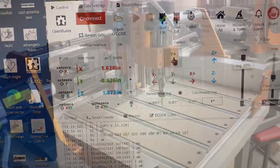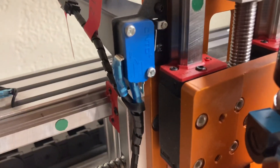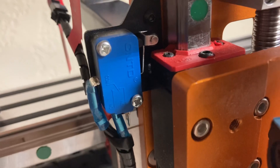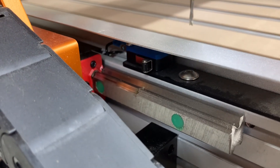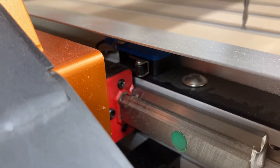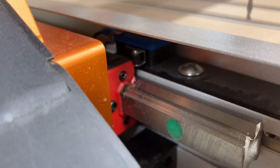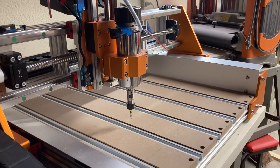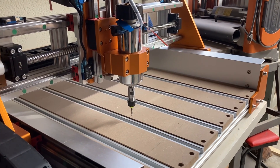Now that is different from when these limit switches are actually tripped. I want to show you the homing cycle again. As this moves up, look how it trips the switch and then backs up — it releases that switch. Let me show this one more time: it's moving down, it trips the switch and stops, but it's designed to back up and release the switch so that you can continue to move the machine anywhere you want.